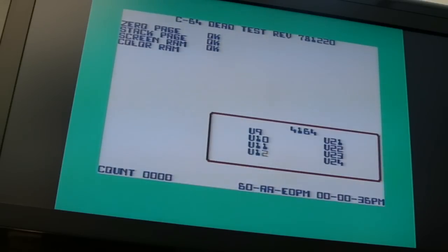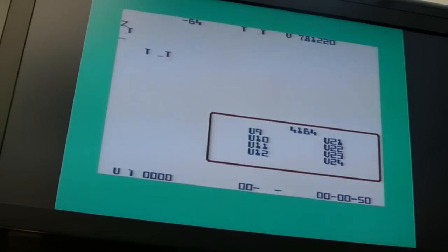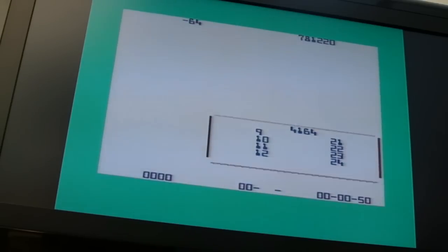Like I say, I started off thinking this was going to be easy, and then it threw me off on the RAM. I did spend 10 minutes doing the whole thing where it says swap chip 1, the number of flashes. So I swapped chip 1, now it's flashing a different number of times, now it's chip 3, swap that one. Oh, now it's chip 8, swap that one. Oh, it's chip 6 now. And I was like, no, this is ridiculous. I'm just going round and round and round. And when you see that, usually it's the 257s.